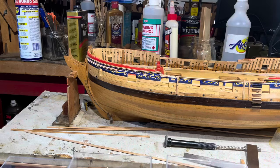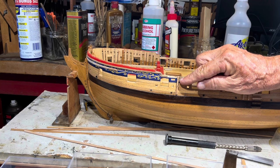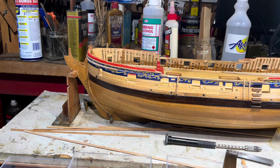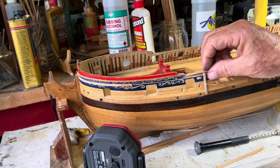We have pinned it in and of course squared it off. The most important thing is that the bottom of the sheave in the piece must line up with the removable block, because the sheet comes through the removable block into the sheave. Now we're just going to do a trial fit with the covering board, and clearly I have to take down the top of that so it's flat, and it's just ready to fit the brass sheave.